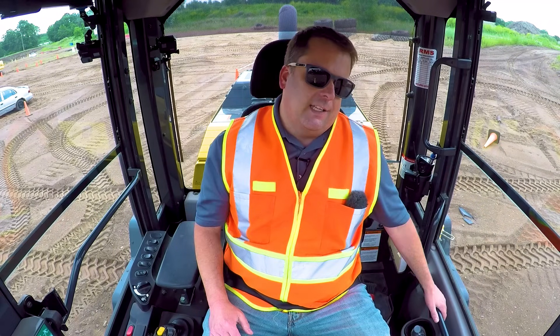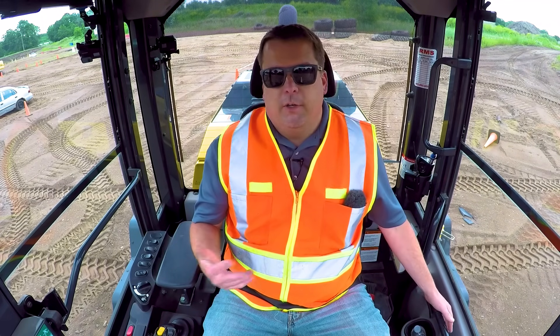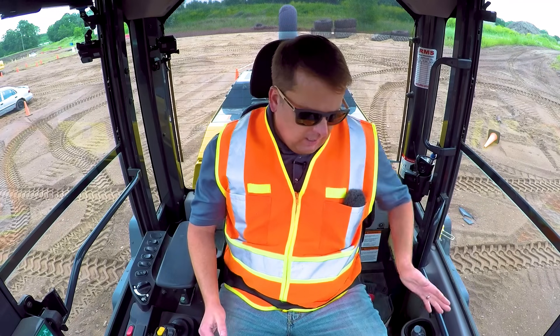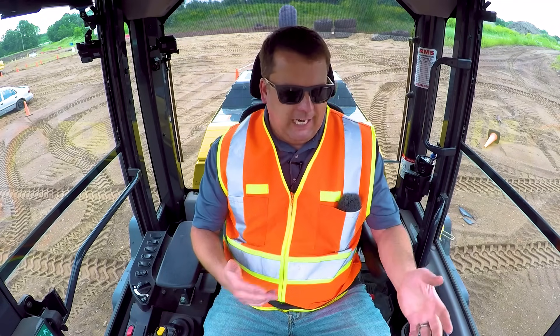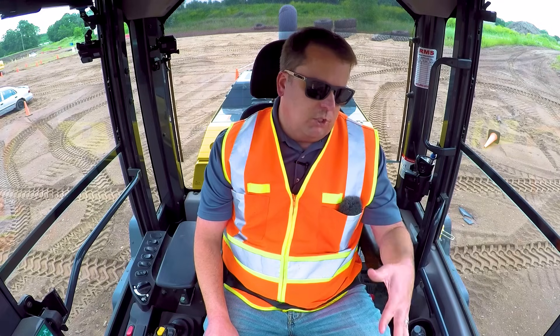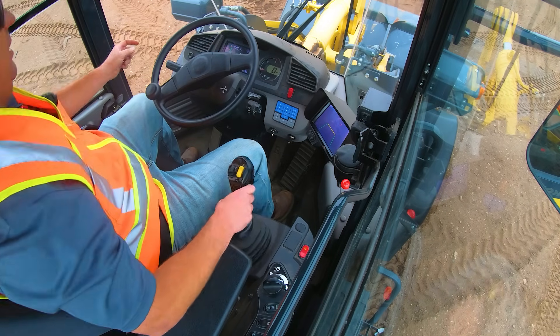I always like to cover safety first. The cab — I showed how the door locks shut. I like to operate with a sealed cab; these are climate controlled. Some operators run with the door locked open and windows down just to hear outside, which can also help with dust. Make sure your seatbelt is on. There's usually an armrest on the side. Then check that your parking brake and other features are operational. On the Komatsu, there's a red P on the dash and a switch for the parking brake so the machine won't roll. And there's a lockout lever on the right side for the joystick, with a red indicator on the dash letting you know it's not operating.